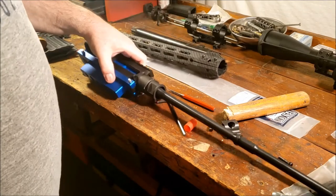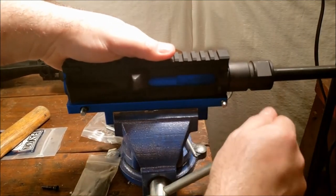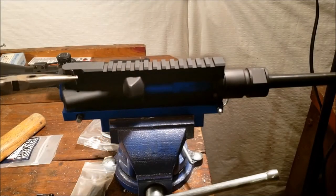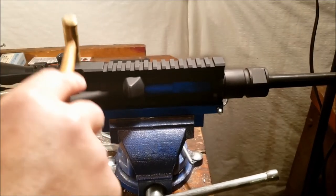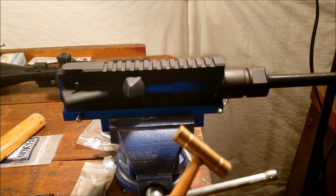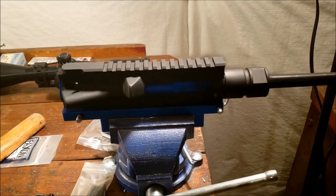Reaction rod comes out. Spin this wanker over here. Lock him in place. Right? Good to go? Not quite. Brass. Hammer. Better to wipe off a little brass rather than, you know, bugger something up. Also, the anodizing, it doesn't take too good to abrasion, man.